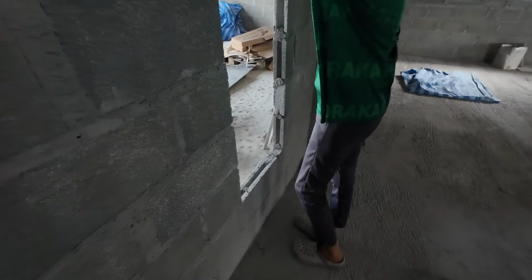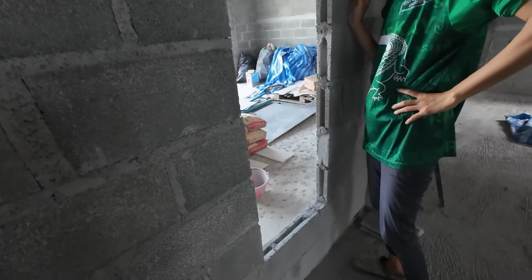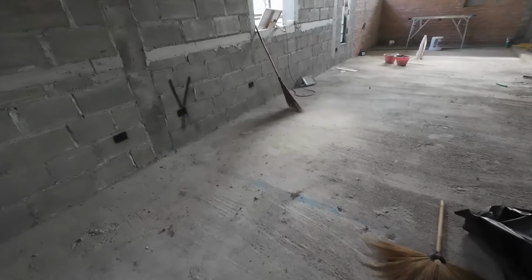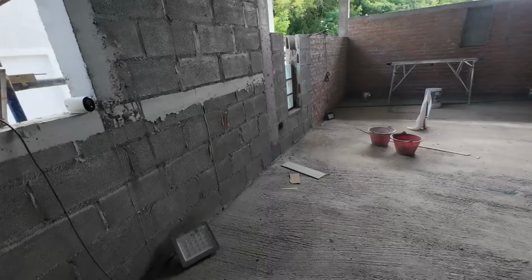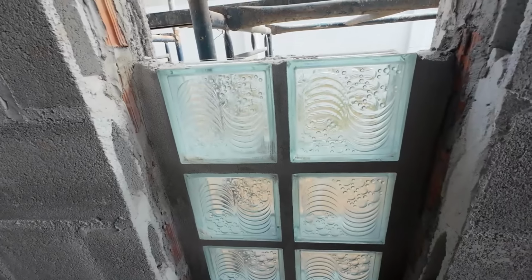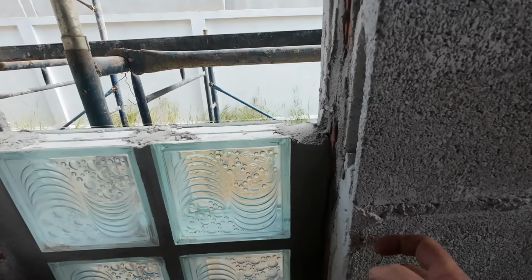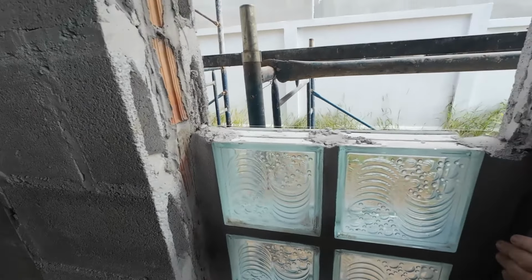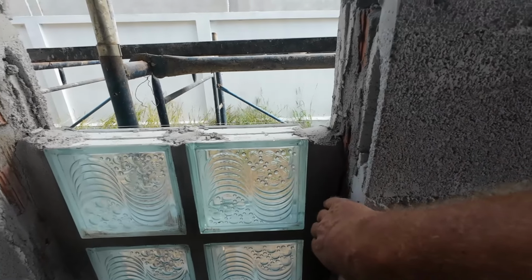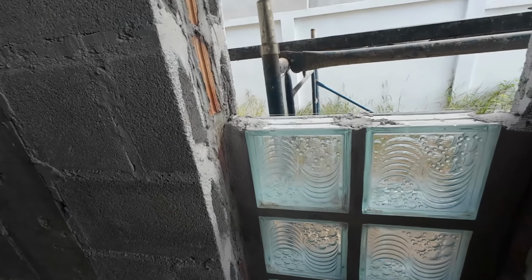So Pi's going to be doing the block glass, as you've seen in the last video. Let me show you what she's been doing, how neat a job. So from 2 centimeter there, then we'll do the wall out here. That'll all fit in nicely, so all that gets rendered up, cemented up and concreted. And then the edge can go in, that'll be perfect. So basically you have 2 centimeter there, 2 centimeter there.